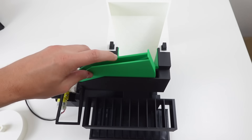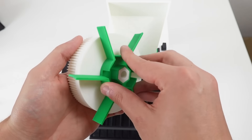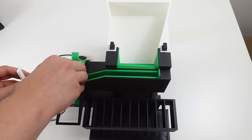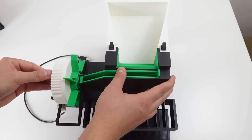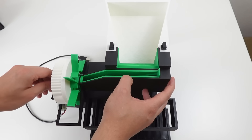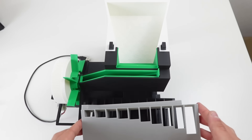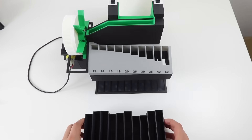Push the rail from the top with a slight angle. Take this gear and push the rotator module onto it. Take the axis with the pin facing upright and lock it in. Add the ramp, the pins and you're done.